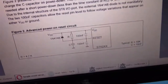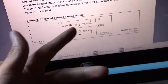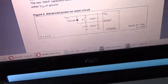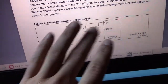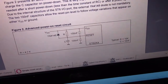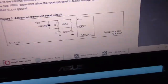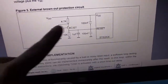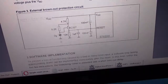But that's another option. So you have voltage divider, bleeder resistor, diode without the RC network if you're lucky, and an actual load change if you want to just apply a load closer to your circuit itself, if you have something that it's powering. It doesn't have to be a dummy load necessarily. And so those are your arsenal. And not including, of course, the Schmitt trigger that you could try, or this transistor as well for brownout protection.